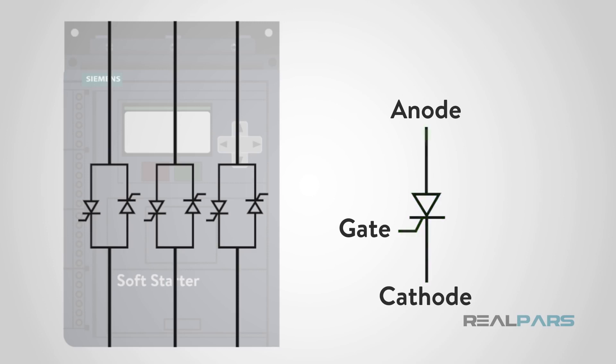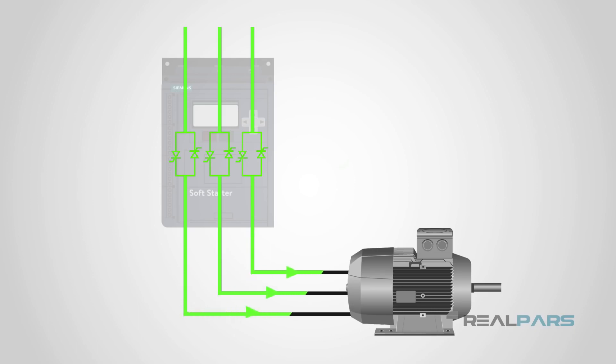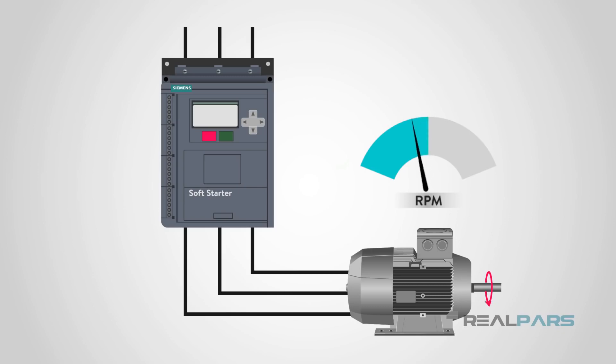When the internal pulses do not apply to the gate, the SCRs are in the off state, and therefore they restrict the current to the motor. These internal pulses limit the applied voltage to the motor, slowing down inrush current. The pulses are sent based on ramp time, so the current will be slowly applied to the motor. The motor, attached to the soft starter, will start up at a nice smooth current and top out at the preset maximum speed. The motor will stay at that speed until we stop it, where the soft starter will ramp down the motor in a very similar way as the ramp-up.